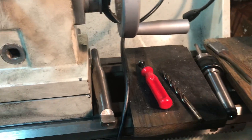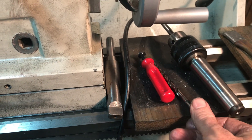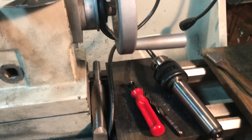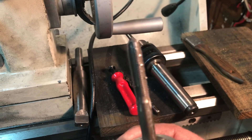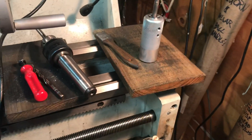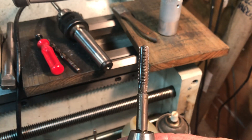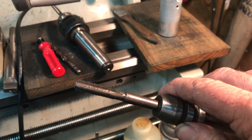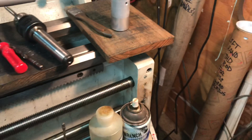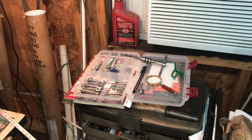Here's the process: I face them off, then center drill with the large center drill in the tailstock drill chuck. Then the tapping drill — I think it's seventeen sixty-fourths — to countersink for the hole. Then I have my 5/16-24 tap. This is the regular tap, which is fine for through holes but not good for a blind hole — that's the word my machinist friends are shouting right now. Here is the bottoming tap. I had a 5/16-24 bottoming tap, and I did this by hand, rotating the chuck to get another three or four threads in each one. I'll do the same thing with the 10-32 tap for the small ball handles.